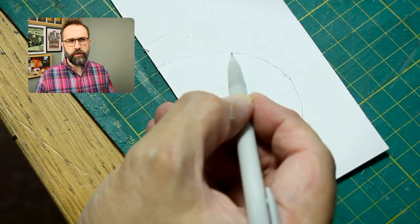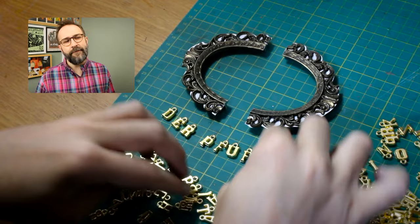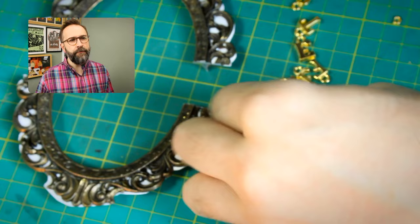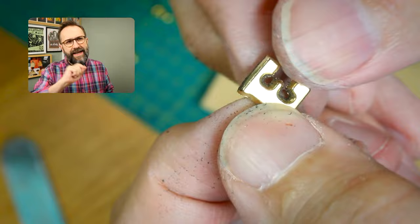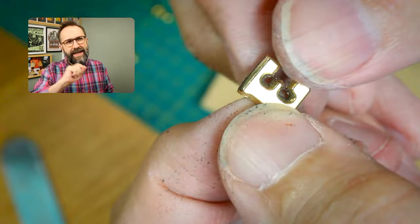Find the letters for your frame - very easy, particularly if you play the shot backwards, like I'm doing here. That's how I do all my titles. I broke my nice snips, so these are dirt cheap ones that work just as well. Cutting the loops off the little letters, and they're twice as thick as I want them - particularly because the back half creates undercuts. So I'm just sanding them on 40-grit sandpaper and now they're half as thick with a nice flat back.